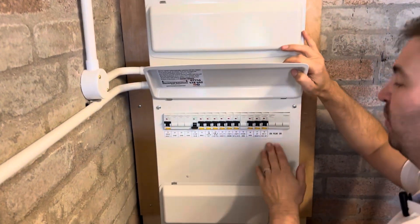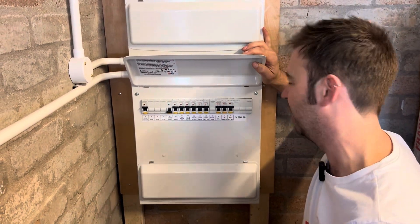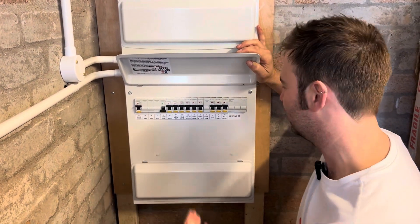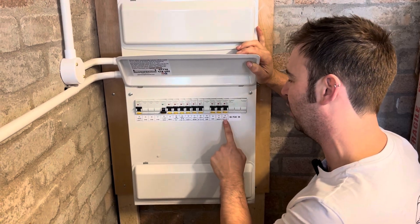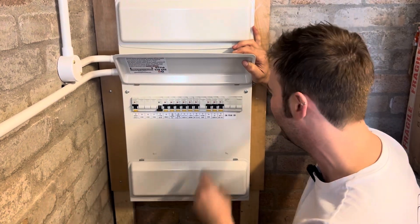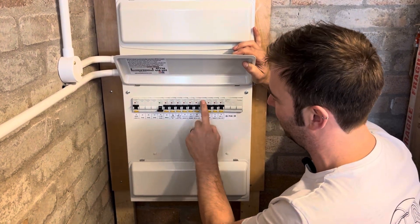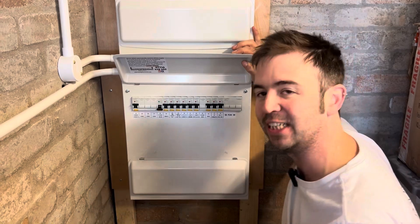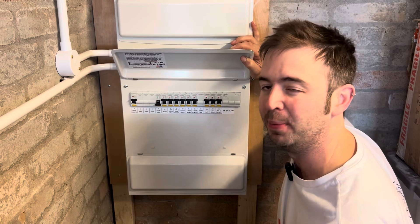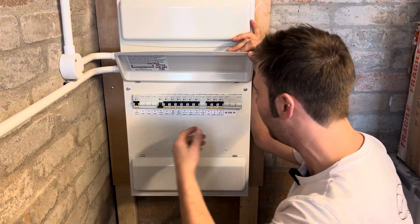Staying with the on-peak supply — the client has got a dedicated radial. He's a bit of a lighting engineer, so he wants to be able to work and if he does something wrong he won't trip the rest of the house. There's a dedicated socket in red so the client can differentiate between house sockets and this dedicated one. Upstairs sockets, oven sockets — there's a future oven supply behind a blank, which is a 6mm cable because they're relocating the oven to the centre of the kitchen during major refurbishment.